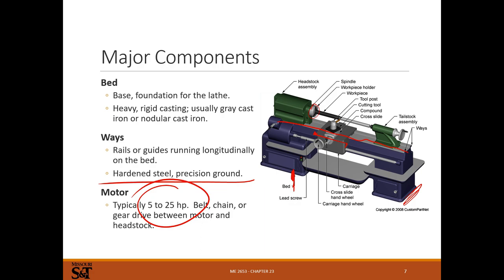You'll need some kind of speed reduction. Motors spin at a few thousand RPM, but you need the spindle to spin down to maybe a hundred RPM or up to a few thousand RPM, so you need some way of changing the gear ratio. That's done with sprockets, pulleys, chains, or belts on pulleys - or gears. Gears are usually the higher-end option. An all-gear-head lathe is usually what you want, where all speed and torque changing is done with gears. That generally works better than belts or chains, at least in my experience. As long as you keep gears lubricated and don't abuse them, they'll last essentially forever.